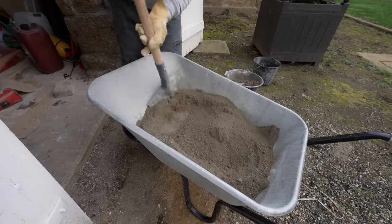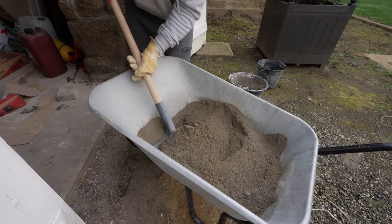Good morning everyone and welcome back to another video. It's Friday here at the convent. Sean is just finishing off a few things in the kitchen - finishing off the expansion joint. This afternoon we're going to pressure test all three zones just to make sure they're okay. The rebar isn't for reinforcing the concrete, it's only for laying the pipes to a perfect grid pattern for a nice consistent layout, and it's probably the most inexpensive way of doing it.